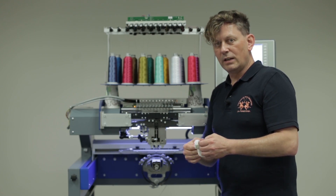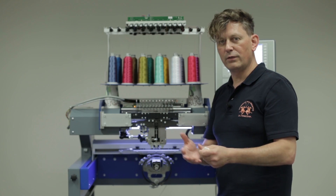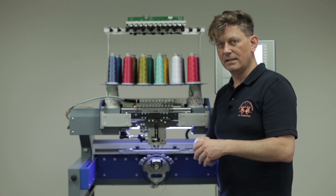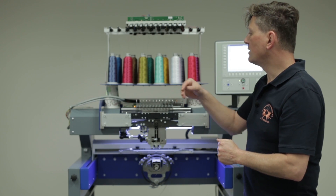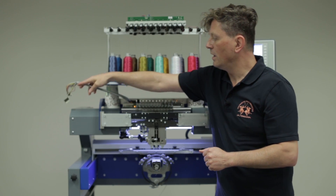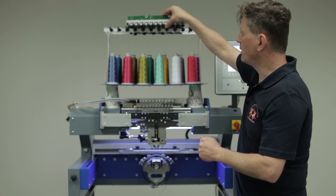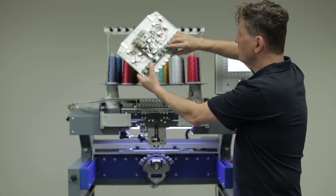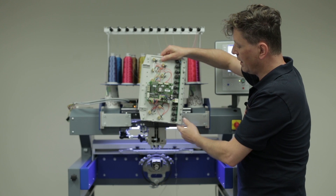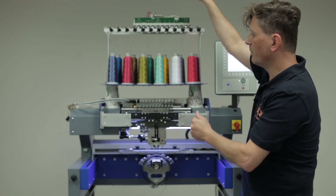I will also tell you about the Jaffa and the Racer series — they already have an electronic or electric brake. In this case it is necessary that you still have your KSB board connected. That is the board which is in our case here above — I will show you quickly. This board has to be connected, otherwise you cannot release the electronic brake on those machines.